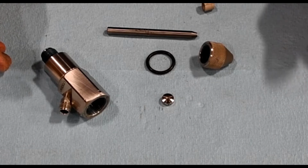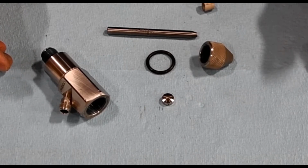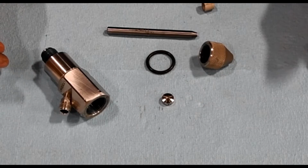So you can put a diamond into the cutting head and not have to worry about it for several months. This is particularly important if you're cutting with multiple cutting heads and you don't want to deal with rubies or sapphires failing at random intervals. You'll also get better stream quality with the diamond.